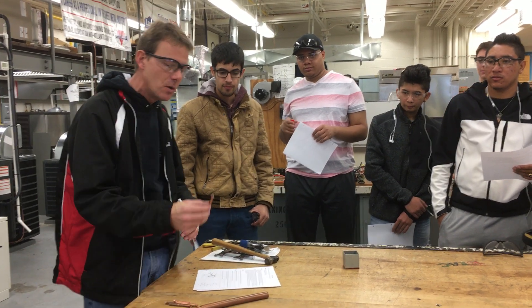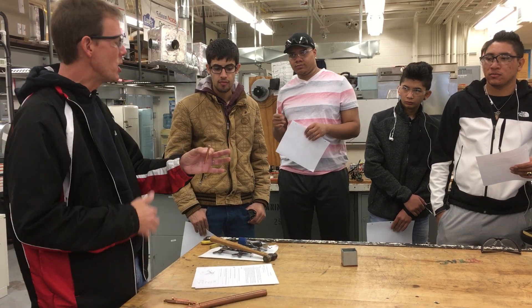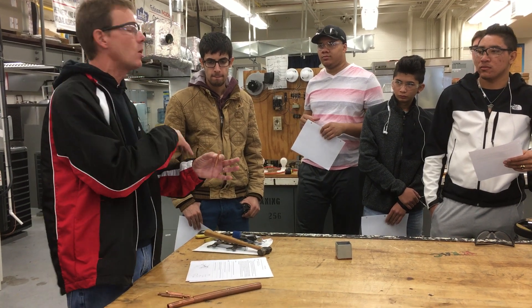The flaring connections I showed you for the first project was just practice, and then you did the multiple sizes with the flare tree, and then you did the filter dryer, which showed that you had to have a good flare to hold under pressure.